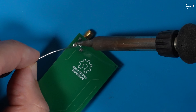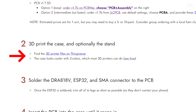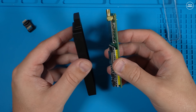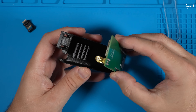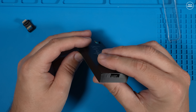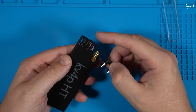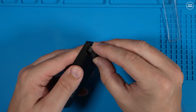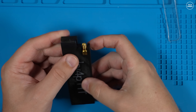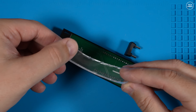Lastly we need to solder the SMA socket — again just solder one pin first to make sure it's flush to the board. Back over on the quick start guide you'll find a link to some 3D printer files so that you can print off one of these protective cases. This keeps the top of the board protected while it's in use. If you don't have a 3D printer, maybe you've got a friend who has one, or you can find somewhere online that can print them for you. There's also a little section where you can store the USB-C OTG adapter when it's not in use — of course you wouldn't really want to lose that part.